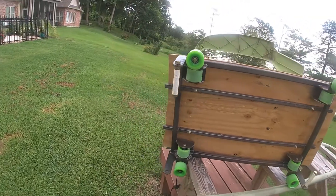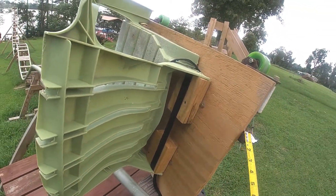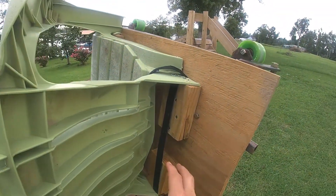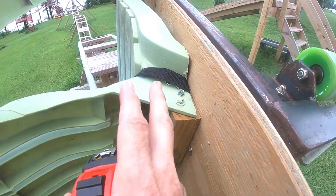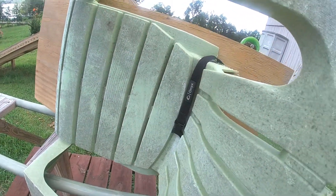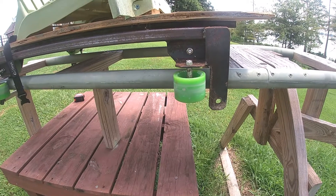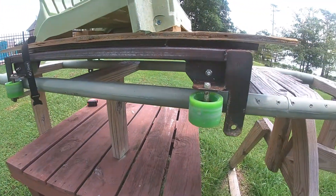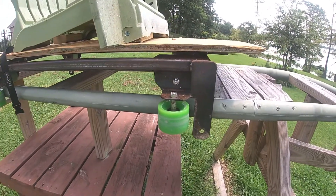That's how I made the cart. I used half inch exterior plywood, bolted it to the steel frame, screwed some wooden blocks to it, then screwed my plastic chair on there. Did the same for the front. I also got a seat belt that I took off of a life jacket. When you order your skateboard wheels, try to get the hardest rubber you can for less friction — I ended up getting some that were pretty soft. You can also spray them with a silicone spray to reduce friction a little.